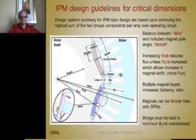Here's some details to look at for an actual design that you would use. You have to sketch things like this. You need an accurate sketch. You either have to do it by CAD, or you have to have some computer software that has templates that you can do this with. So you can iterate and go through the design, because you have to pay particular attention to all these dimensions. You have to use some of these dimensions for mechanical stress calculations and other dimensions for magnetic flux calculations. So it's a combination and an iteration of the two.